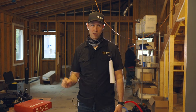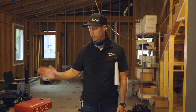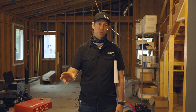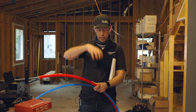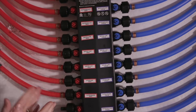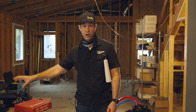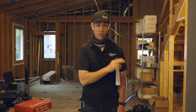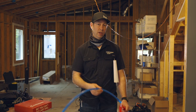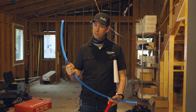What's really annoying about manifold systems is that if I just turned my faucet on and my wife comes into the bathroom five minutes later, she also has to dump seven and a half cups down the drain before it gets hot. And that manifold bullet in the basement is a pretty thick pipe, so there's a fair amount of cold in there that needs to get expelled first. With longer runs of 100 pipe feet, it gets twice as annoying. I've stayed away from manifold systems — I think they end up wasting more water than you'd expect. That said, I like that there are fewer fittings and you can shut off each branch individually, so in a smaller house they could work well.